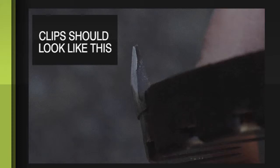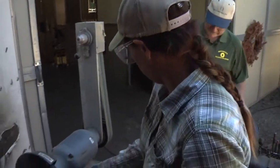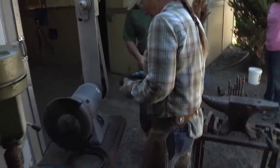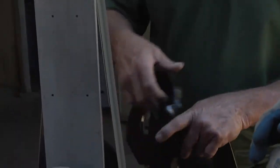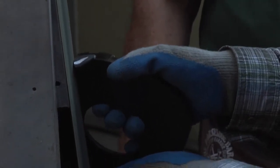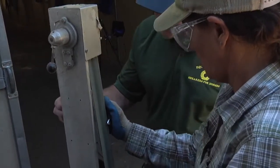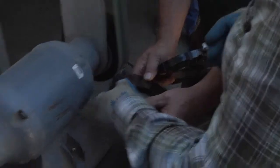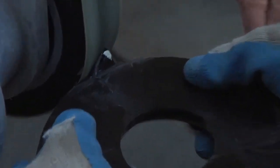So now you get to do it. Just be careful when you're grinding — you don't want to thin the base, especially right there. You have to learn the feel of this. Then you turn it around and do it like that. Just as parallel to the belt as you can — there you go — just kind of roll it back and forth, taking the corners off. That'll be just a round top — a little tap there and you're done.